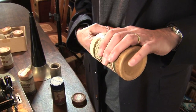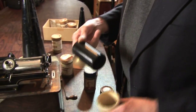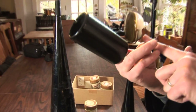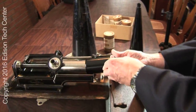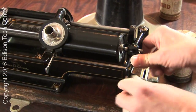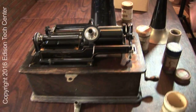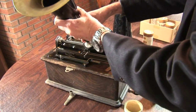This is one of my favorites. A lot of these records are pretty bizarre, but this is a whistling record — 'Over the Waves.' Notice how I'm handling this — this is the way you handle a cylinder record. You just put your fingers in; don't touch the grooves. Just open the loading gate, go in like this, close the loading gate, and snap it down, because there isn't a reproducer over the record.